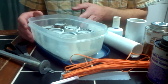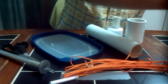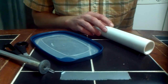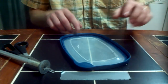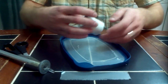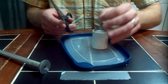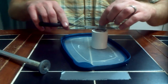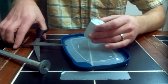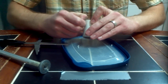This is actually a very simple step in the process, but it definitely needs to be done right. I get everything out of the way that I don't need immediately and concentrate on this just step by step. The first thing you're going to need to do is remove your Bates grains from the casting tubes that we used last week. These have been sitting for about seven days in an airtight container. The reason I leave the Bates grains inside the casting tubes is because it will definitively hold that 1.25 inch inside diameter.